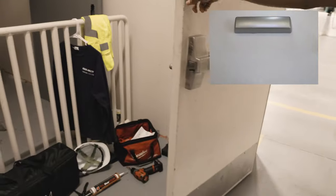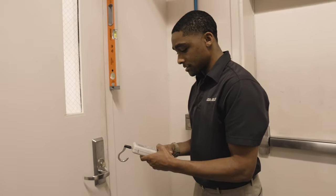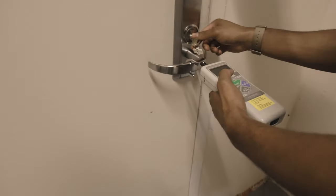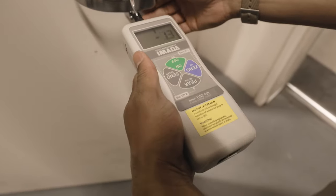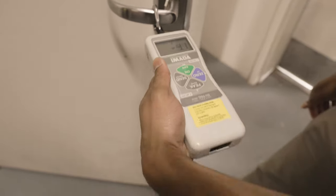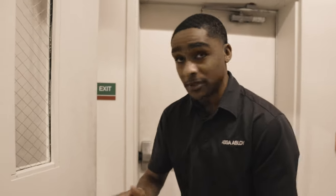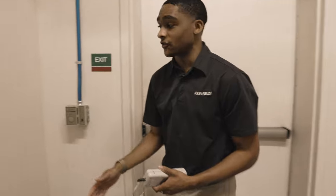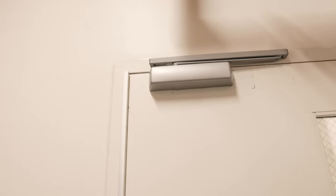Our cam closer works quite a bit differently than a rack and pinion closer. There are actually two pistons inside the closer, two springs, and then there's a cam. The door is latching securely. Let's pull our force gauge out, put it back on peak. I'm going to about six pounds. Taking it off peak to show the real-time reading — between three and four pounds after we get past that latch. So quite a bit easier to open this door. We did peak around six, six and a half, which again is acceptable for a fire door. Much, much lighter open than we saw with that rack and pinion closer, and we're getting this door latched pretty securely.